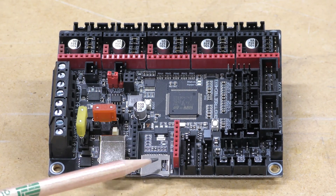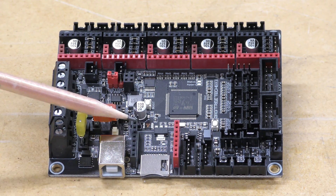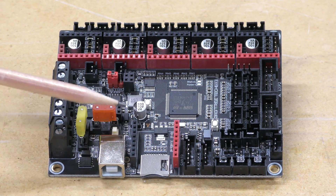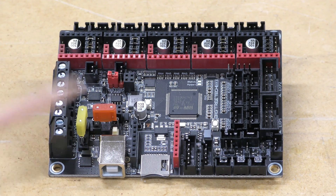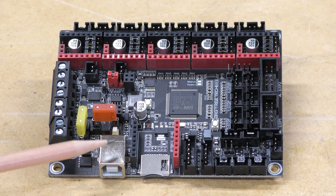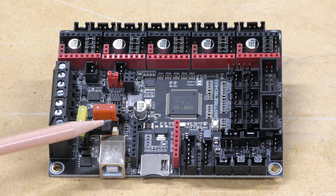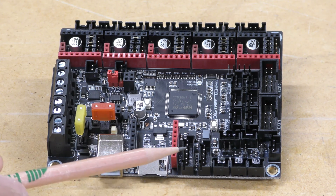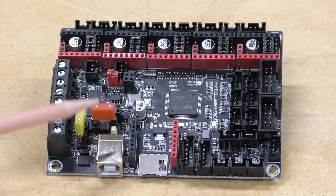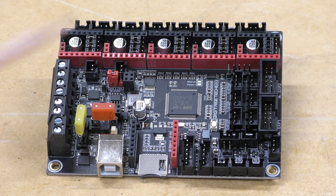This is the interface so you can put a micro SD card in here, and these are to hook up a Wi-Fi module so you can connect it to Wi-Fi — again, very cool. This of course is the USB connection to hook up to your mainboard. This button right here, if you press that down, activates the CAN bus so you can control everything through the CAN bus instead of the USB.